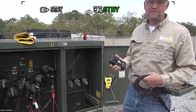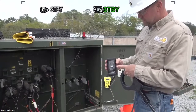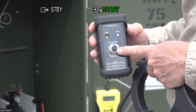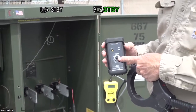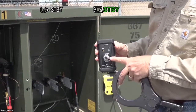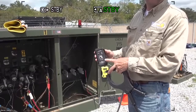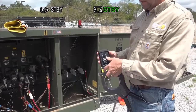I'll talk a little bit about the DAVR as it's ramping up in current. The DAVR is a digital audible visual — it has a horn built into it, a white LED light built into it, and a 10-turn potentiometer. You always want to start with the potentiometer in the zero position. It does have a locking thumb tab so that if you do set it at some threshold, you can lock it in place so that if you inadvertently hit it, it won't adjust the sensitivity.